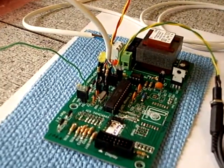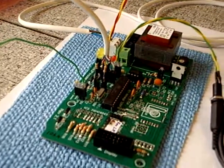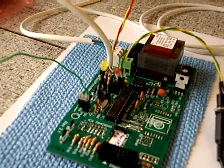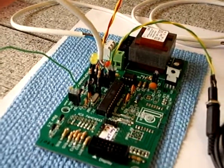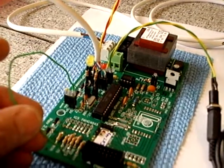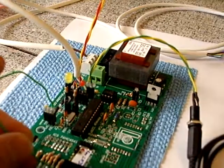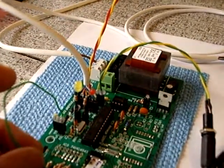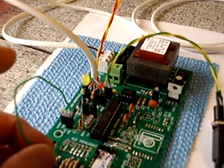It looks fairly clear that the red one on the right is flashing just before the yellow one on the left. On this particular sketch, I've arranged that if you earth R11, Resistor 11 — the track here, that's Analog 0, otherwise known as Digital 14 — if you earth it, then you'll find both LEDs will go on and you can flick them both on and off.